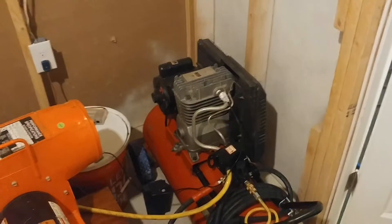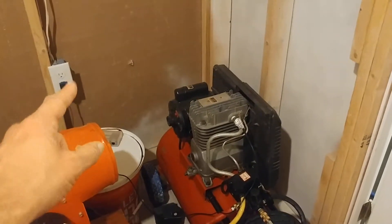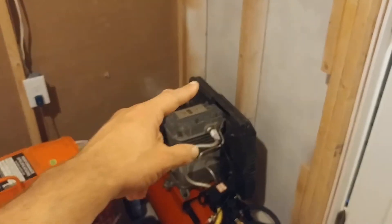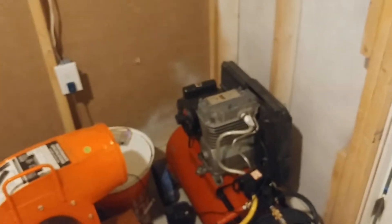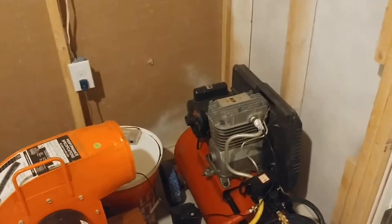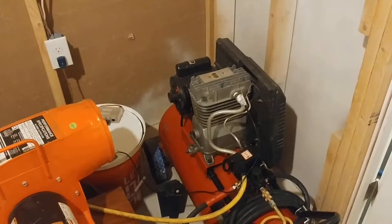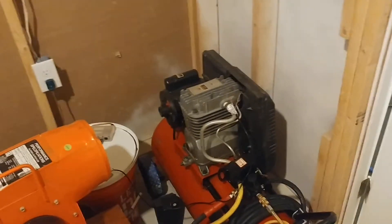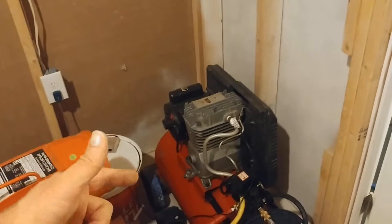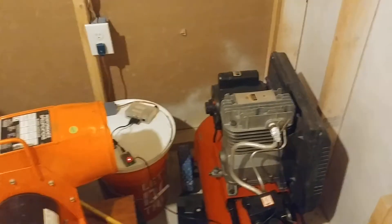This thing runs the whole time. You'd think with the way a plasma cutter works it would have some time to catch up, because you rapid over to one spot, do a probe, do a cut — but no, because the plasma cutter has a purge cycle where it keeps bleeding off air for 20 to 30 seconds after every cut, meaning it's drawing the full air the entire time. The thing that limits duty cycles on basically anything is heat buildup. So if we can remove the heat, we can improve the duty cycle and make this air compressor last a little bit longer. I decided to try these external fans to cool it off and get nerdy with some data to see how much cooling we need and how much we're getting.